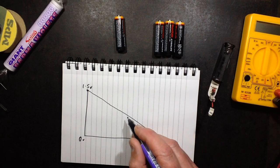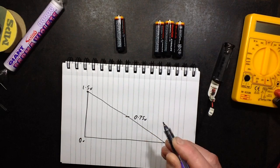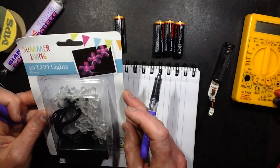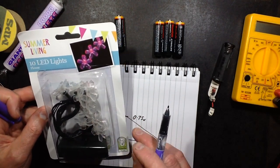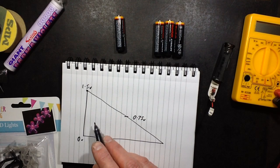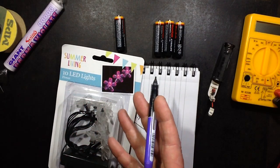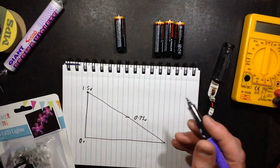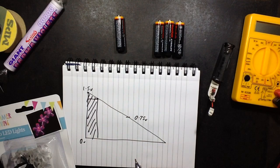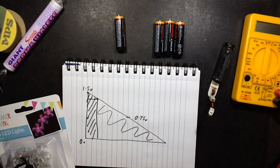The official point at which a battery's capacity is classed as dead is about half the starting voltage, so about 0.75 volts. Many electronic devices — for instance, this set of LED lights from Poundland, magenta colour LED flower lights — take two of these cells. The LEDs light brightly at 3 volts, but around 2.5 volts or 2.4 volts they're virtually out. So these will only use capacity down to about 1.2 volts per cell, and the rest is wasted. Many other appliances only go down to about a volt, so ultimately you're wasting lots of battery capacity — and that's where this little circuit comes in.